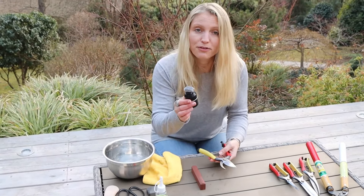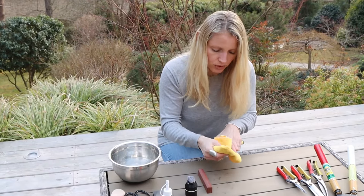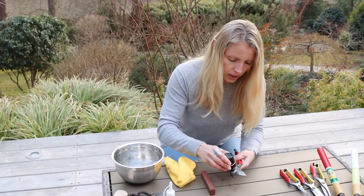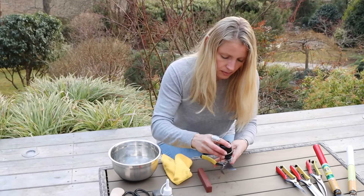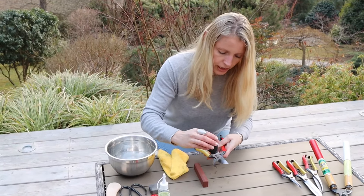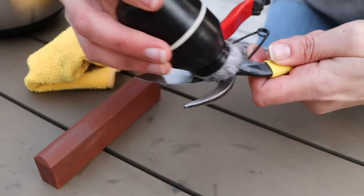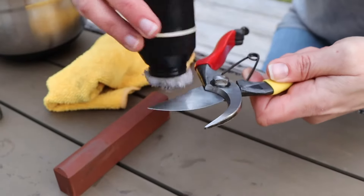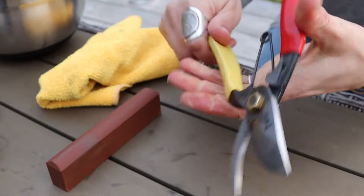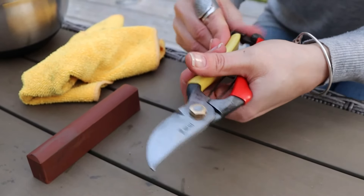I am now going to continue with the other tools, but before I do, I almost forgot to put the final layer of camellia seed oil on. First making sure that everything is really dry, because a little bit of water comes from the stone onto the tool, and that is okay. Then I just apply camellia seed oil with the dispenser bottle along the blade and also around the bolt here, so it keeps it nice and lubricated. The oil I am putting on now is just staying on — I am not wiping this off again — and it will keep the tool nice and smooth. That is the process I do for maintaining the tools.